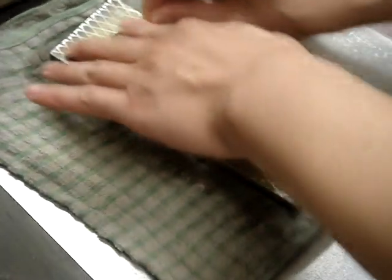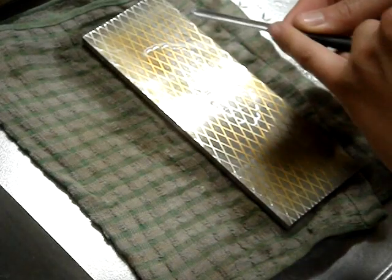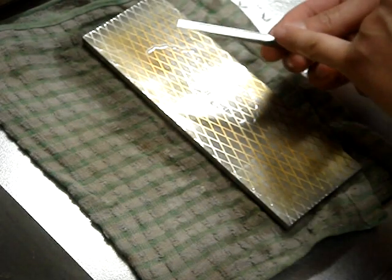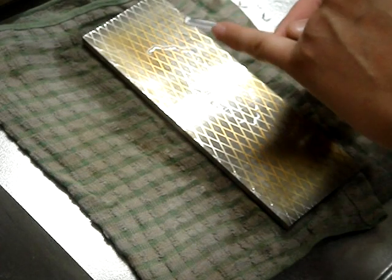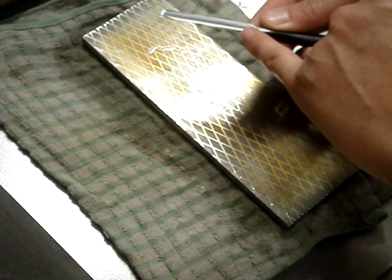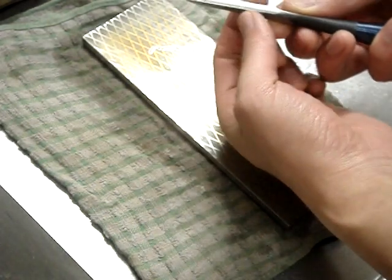On cheaper chisels, you'll have to do this a lot, and what will happen is you will bring down... Japanese chisels have this kind of hollow in the back, which you probably already know about. It's to help sharpening. The hollow should almost be the full width of the blade, and there should be a really thin piece of blade left on either side, and they should be thin and even.